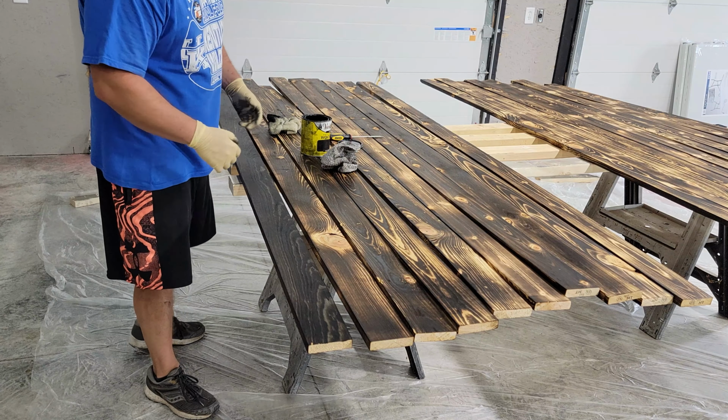I have to let this dry a little bit longer to actually put my polyurethane or my sealer on there. So let me show you what I'm going to use. I'm going to use this Bona Mega 1. It's actually for floor finishes, so I felt like this would be really good for trim work because it would protect it really well. I had this left over. This is pretty expensive, I guess, when you're talking about per gallon, but if you're interested, I'll have a link in the description below for it. I actually did buy this off of Amazon. We finished a floor in a previous house and I had this one left over, so I figured, why not?